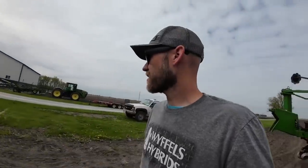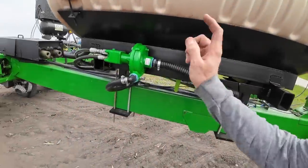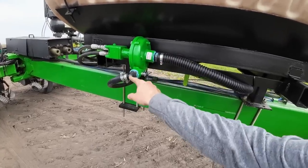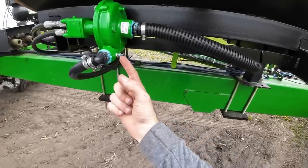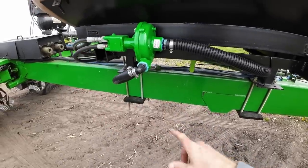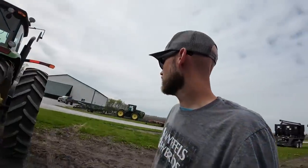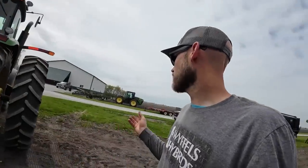Dad came and picked me up — he got the parts and we're back at the planter. What we've got going on is we rebuilt the pump and put a new impeller in it. But now it's leaking right here — we had to cut this hose off a couple times and I think we scarred the hose barb, so it's just spraying out of there. He got some parts and talked about changing it to one-inch line, but I'm not sure what he ended up getting, so I guess we'll find out.